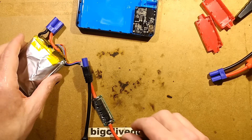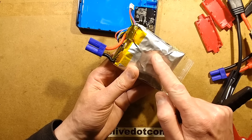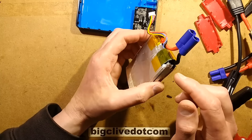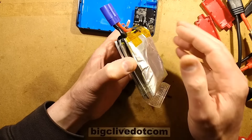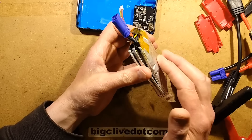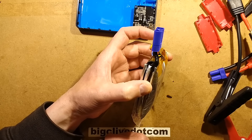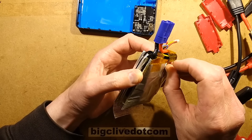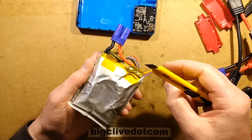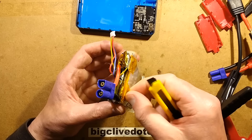One of the cells - the top one - is the one that actually failed and limited the current in doing so. The voltage measured across it is now only about 1.6 volts, but the other two cells are still measuring over 4 volts, suggesting not much energy was dissipated overall before this one sacrificed itself to save the others. The temptation is to look closer at this - I really should have got gloves. I'm not sure I should be opening this pack given it may still have quite a lot of energy left. Slitting the lithium pack with a knife doesn't strike me as clever either, but that kind of sums me up - recklessly foolish.